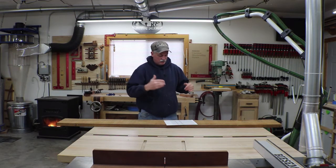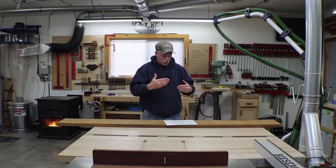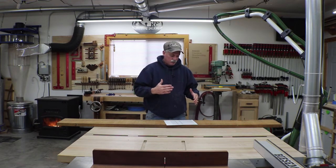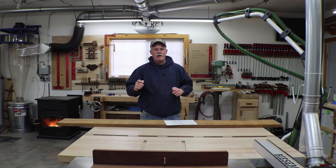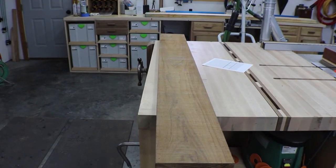The mounting strips will be notched into the back, and then the towel holders themselves will be mortise and tenon, or I may opt for simplicity and go with dominoes — we shall see. Here's the lumber: it's full four-quarter teak. It's hard to see the grain because it's all rough cut right now, but once we get it trimmed down and the pieces milled a bit, you'll be able to see more. We're going to start with breaking down the lumber.